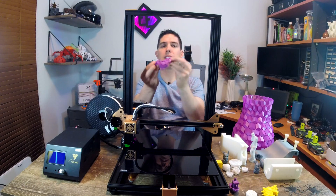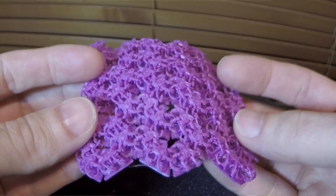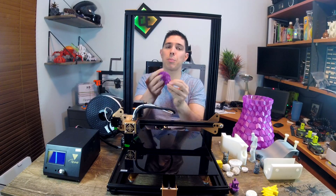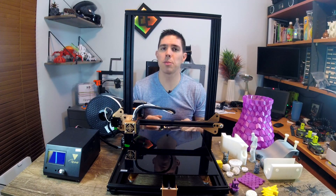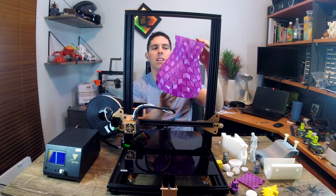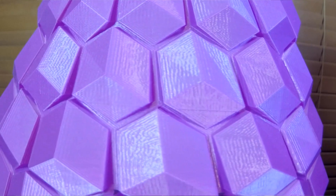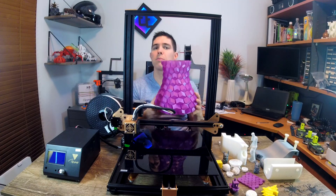Next I did a chain mail print which worked out pretty good but wasn't easy. As this is a Bowden extruder - just like with the Ender 3 - if you're not careful upping your retraction means the filament will slowly reverse out and the print will fail. I had to turn it way down which left some stringing, but with the usual tricks it now has a pretty nice flow. I then did a vase from the front page of Thingiverse - the way it catches the light is absolutely stunning. Done in vase mode, it took around six hours. It's not meant to be watertight so there are some holes - that's the design's fault - but it's a beautiful thing, and it's not even filling the entire build volume so you could make things even bigger.